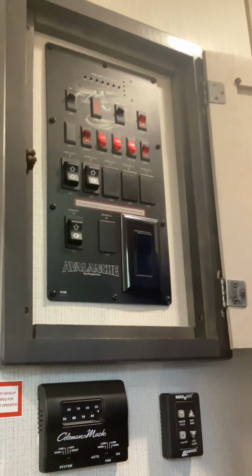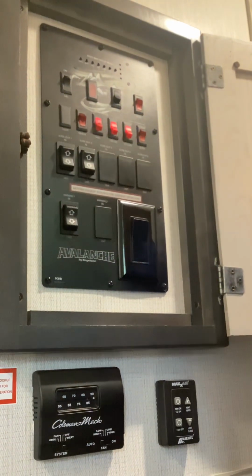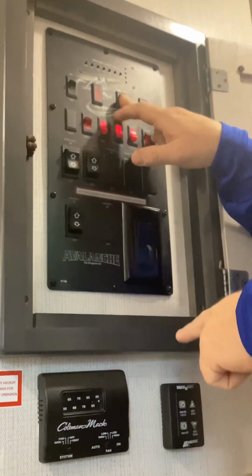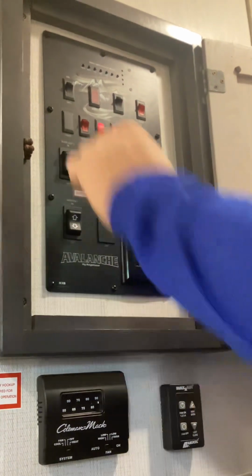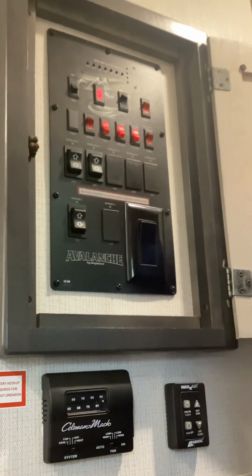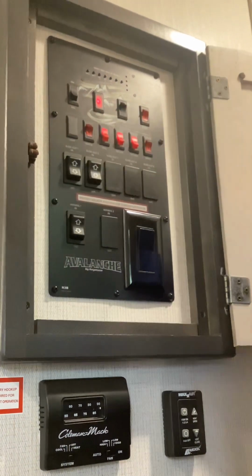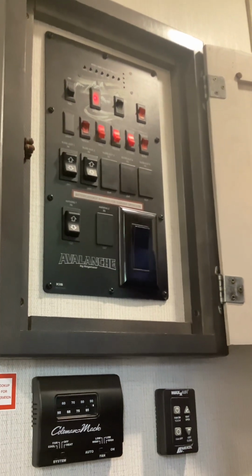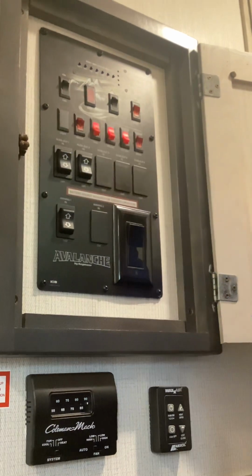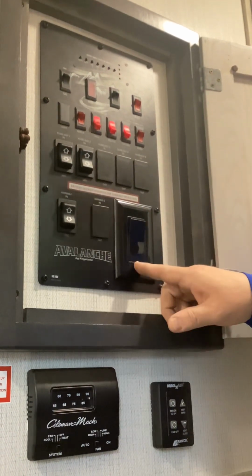As I was mentioning about your water heater, it works on both gas and electric. There's one electric switch here, which is labeled electric, so you need this switch on and the switch outside that I showed you. When you want to run it on gas, you're just going to hit your gas power on. The light's going to stay on. When it's lit, that light will go off and stay off. Fortunately, we can't let it run right now because there's no water in your tank. Light switches, as I said, slide controls, and then ceiling fan switch.